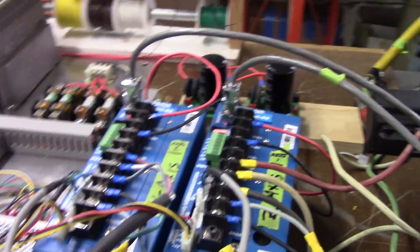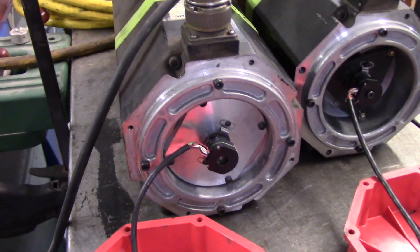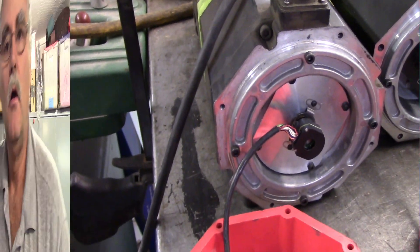So we've configured the drives with the software. Now we're going to go over how to align an encoder in the manual. Before we get further into aligning the encoder, we follow the manual. You'll see that big red stop sign on that page. It says: check for greater than 100 megaohms between the motor chassis and the motor power terminals. This is very important and you should do this even before you consider doing this upgrade. You want to check that your motors are sound — no leakage from motor power coils to the chassis, or you're going to damage the drive. Check for greater than 100 megaohms between motor chassis and power terminals.